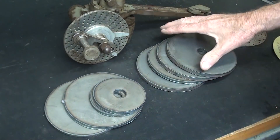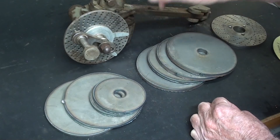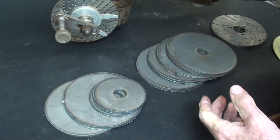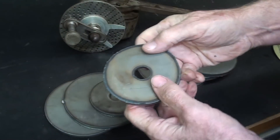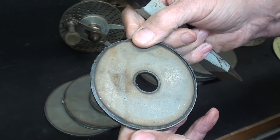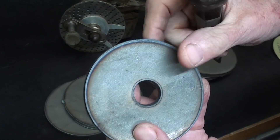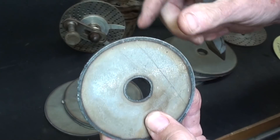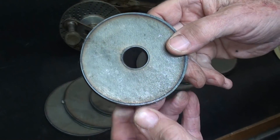That concludes this video. In the next video I will be making a plate for this Master dividing head using a couple of different methods, and then we'll move on to the Hardinge. These will be cleaned up — the slag will come off very easily — and they must, of course, be turned down to a certain diameter and bored to one-and-a-quarter so that it will fit on this. That's just a rough cut with the plasma cutter. I hope it's not too hard when I go to bore that. See you next time. Thanks for watching — this is Mr. Pete saying so long for now.